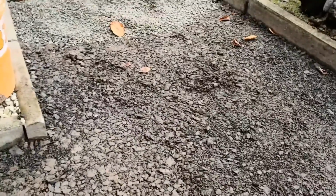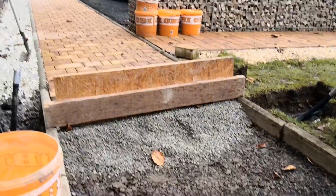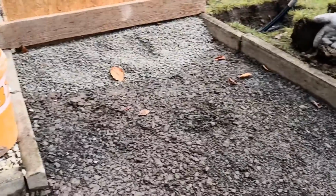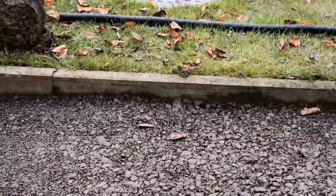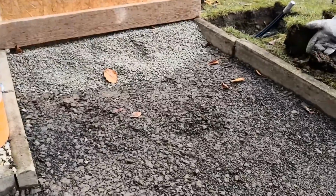It gets really exciting when you have larger areas. For example, here at this corner, I usually use larger pullers, or the very large spirit levels with a length of 2 meters or 3 meters. I securely attach my leveling board to these long strips with a sturdy clamp. Then it will be pulled around the corner in a very smooth and controlled manner. This way, I have nice even areas that are uniform from edge to edge.